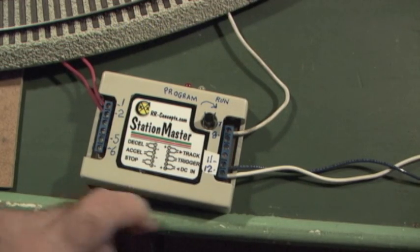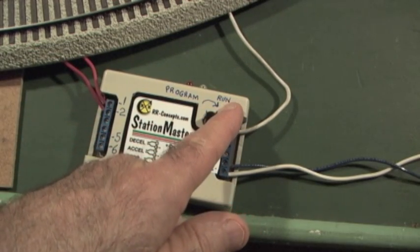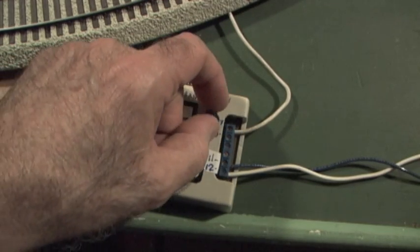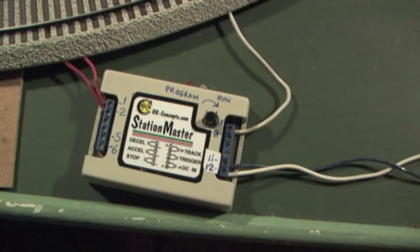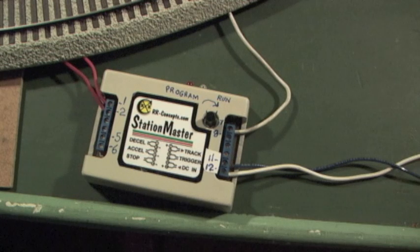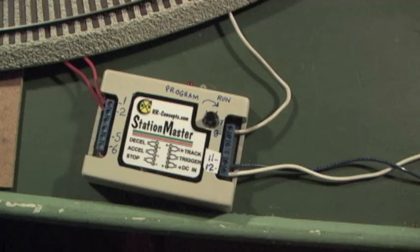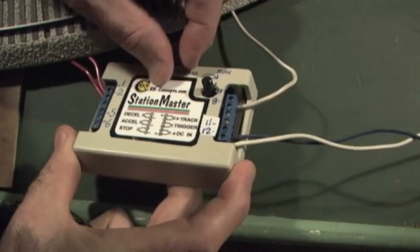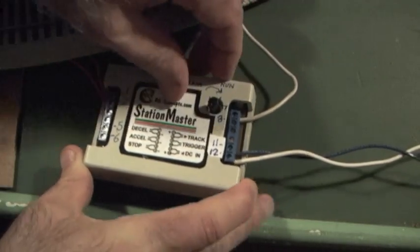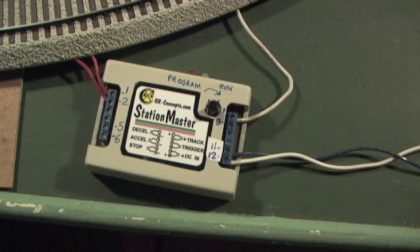As you recall from earlier, this little control rod — you turn it clockwise for the normal run position, or counter-clockwise for the program mode, which I've already done. It's turned in the counter-clockwise position. Now halfway down is about six o'clock, so I'm going to turn this down to about six o'clock. There's a little detent, a little dot in that knob — I've got the little depression in the knob down about six o'clock, so it should be in secondary programming mode.